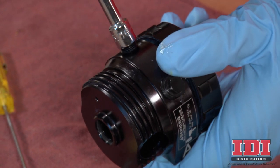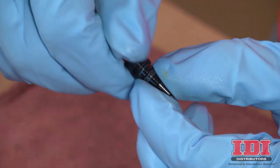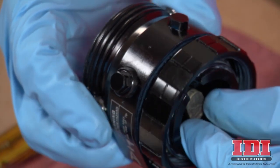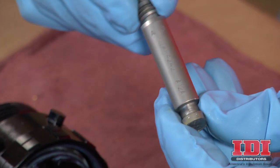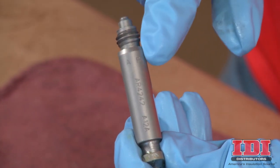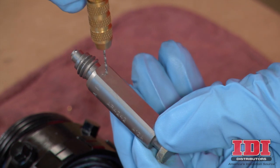Using a 5/16th inch driver, remove the clean-off air valve and inspect the O-ring. Next, pull the mix chamber out the rear of the fluid housing and inspect for damage. To prevent cross-contamination of the gun's wetted parts, the mix chamber is marked with an A and a notch on the back edge. When installing, be sure the A side of the mix chamber is on the A side of the gun.